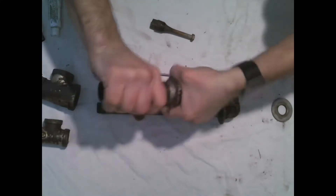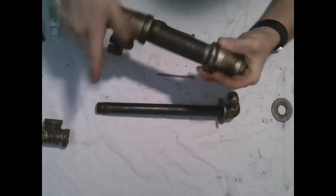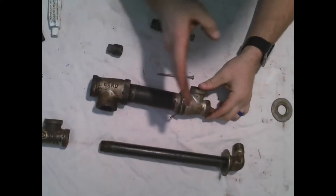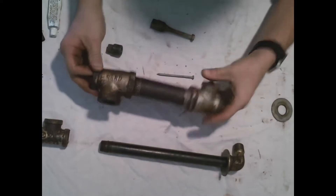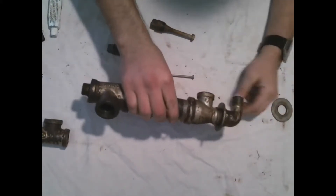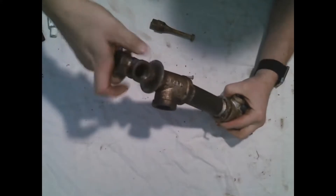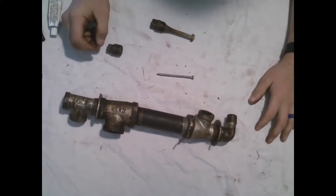Take the one-inch pipe. The speed I'm going is actually quite slow — I'm trying to do this so you can see what's going on. I took my one-inch, three-quarter, three-quarter T — and in this case the one-inch, half-inch, half-inch — screwed it together to this one-inch pipe. Put my street elbow on this end with a washer. Ta-da! You've got the makings of a reactor. Take your half-inch T and your washer — washer goes first, then the half-inch T. That right there, folks, is your reactor. Super easy — my kids could probably build one of these.